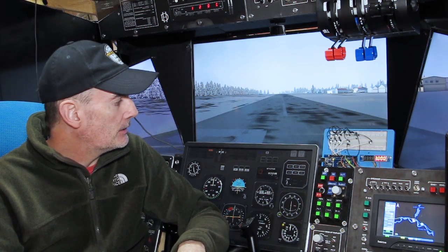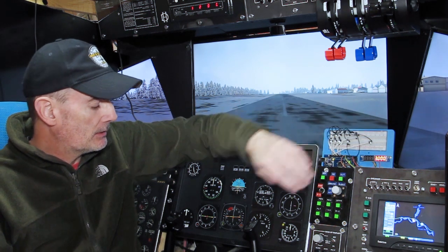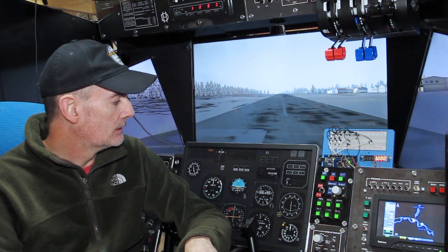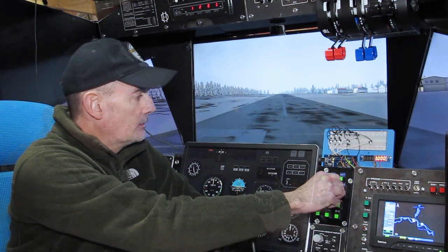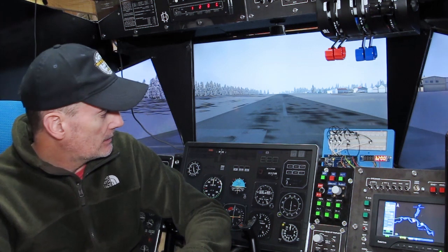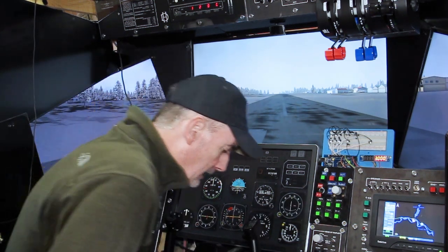Next step complete. We've got the altitude alerter display over here — hopefully you can see that. I've also taken away the LED for the autopilot disengage and replaced it with the altitude alert signal light — that's the light that goes on a thousand feet before the selected altitude and stays on until 300 feet to go. All the buttons are still working the same as before, and you should see I can pre-select the altitude and it faithfully follows what's on the display. I'll zoom in so you can see it a bit more closely.